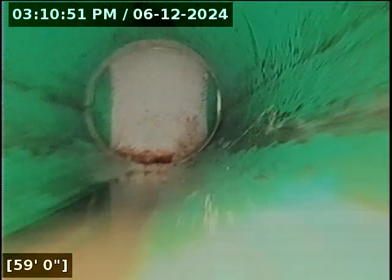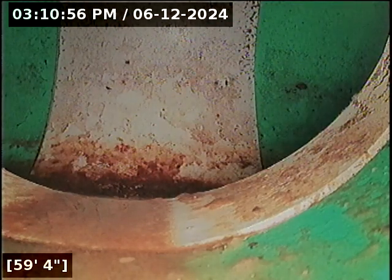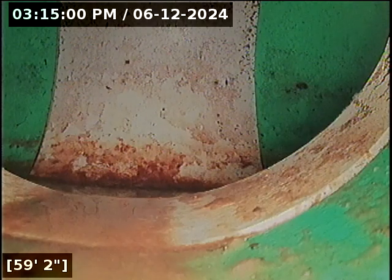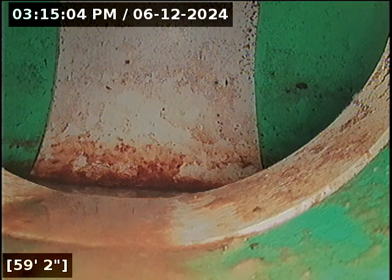And right up ahead here is the main lateral connection, about 60 feet. We're going to go locate that. Line's already drained off here, so we'll just reel the camera back in. Good looking sewer line, and it is functioning properly at this time. Alright, located the camera head successfully. Line terminates out on East Province Court.